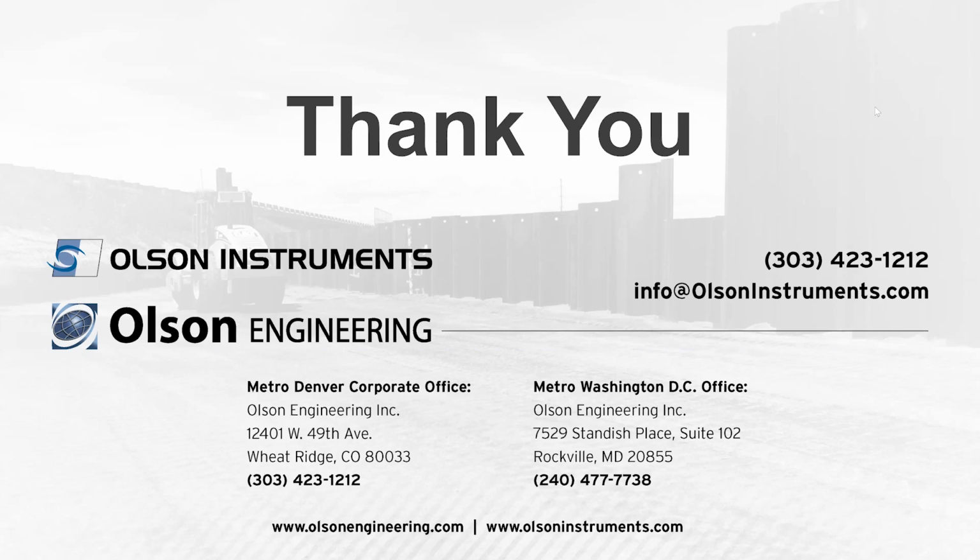And then somebody asked you to repeat your comments about the advantages and disadvantages of the different LWD models. Well, we have a biased opinion there. The reasons we like ours: number one, we measure the force. We think that's important. Two, we use a geophone to measure the displacement to minimize the integrations to a single integration. Three, we use a steel spring. It's less temperature dependent. We get more consistent force. It doesn't really age over time.